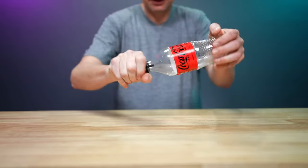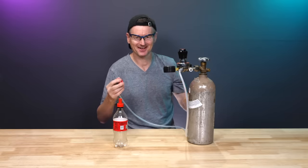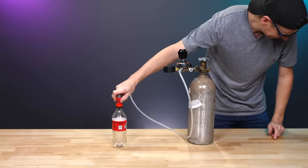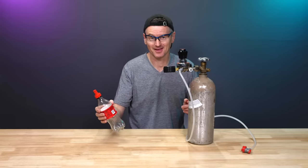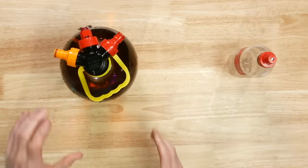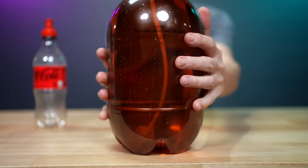Back on with the carb cap, just finger tight. I'm going to stand off camera a little bit - let's do this. I just realized I had my regulator set to three bar, not two bar, so much for going over a little bit with hydro testing. So how much liquid out of a keg can this bottle of CO2 at three bar dispense? It is a 20 fluid ounce or about 600 milliliter bottle. I have this mini keg here - the Oxybar keg. It holds four liters of liquid.